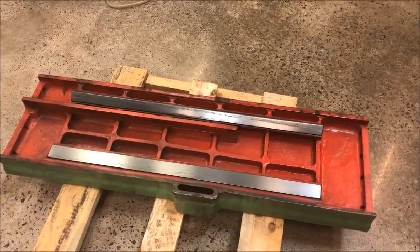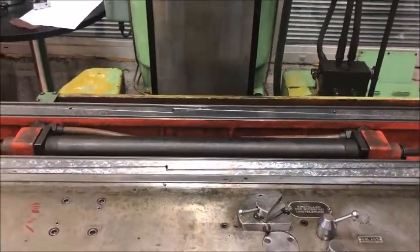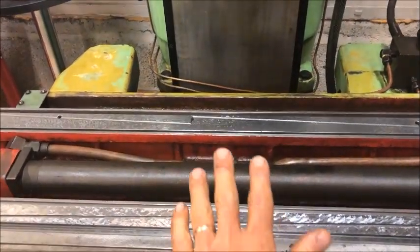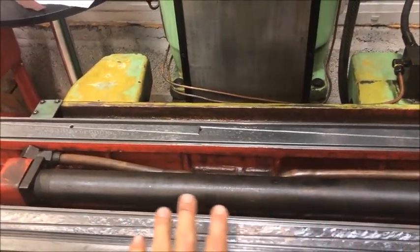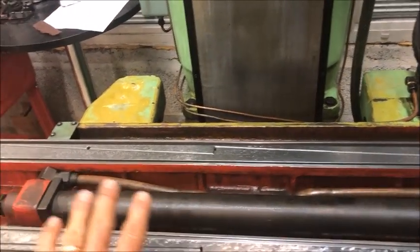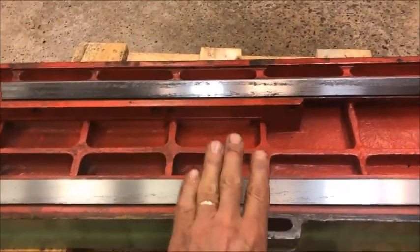The table here is shorter than the saddle. And I think what has happened here on this machine is that it's been used for shorter parts, so it's dug a hole here. And on the same mating part, the table is bowed, because it was high in the middle - it was high here.